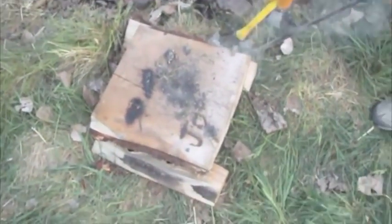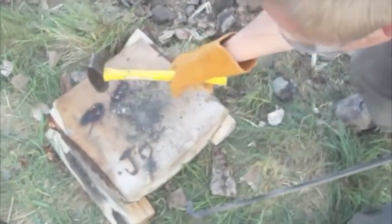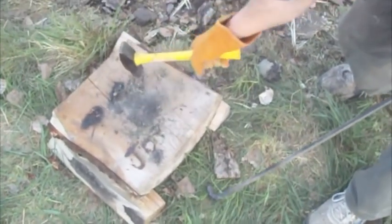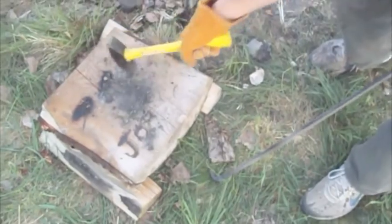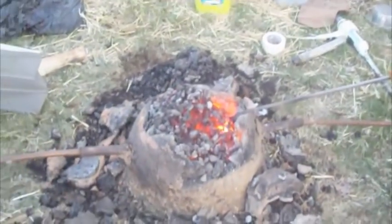Clinkers or stinkers, as Joseph says. What we're hoping to get out of this furnace is a large mass that looks something like that. That's a clinker, which is another piece of trace minerals, kind of like the slag. What we're hoping to get out of here is something that looks roughly like that, but it's actually made of iron, so it'll compact and dent like putty when he hits it with a hammer. And we haven't seen that yet. We're still hoping to pry out another piece.